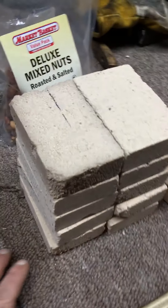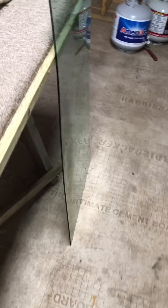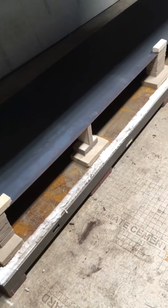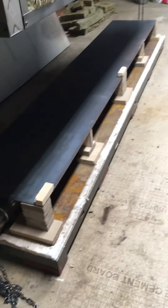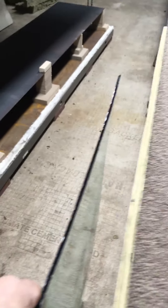Our sample worked, so we're going to cut these up into inch and a half pieces, stack seven pieces in the oven, heat them up to 900, and just let it cool. That's our oven — we had a couple more modifications: we skinned the bottom with some sixteenth-inch sheet steel and the top with eighth inch. We also extended the flame tube out of the oven so it's not getting any direct heat, and hopefully we have no distortion at that end anymore.